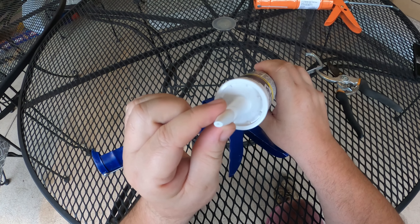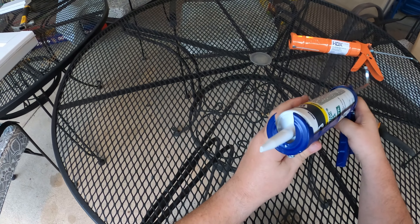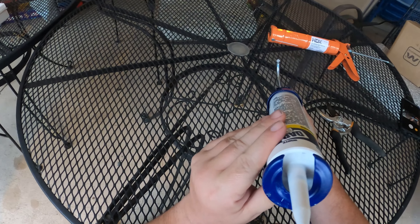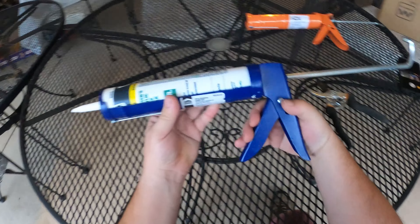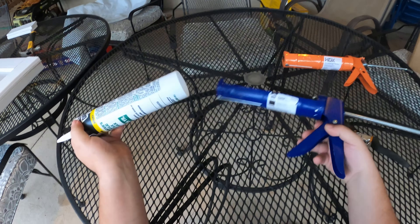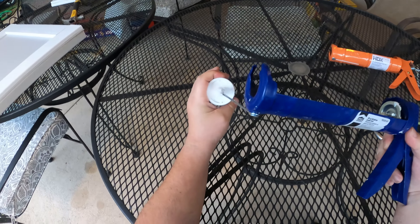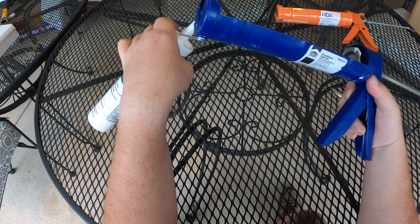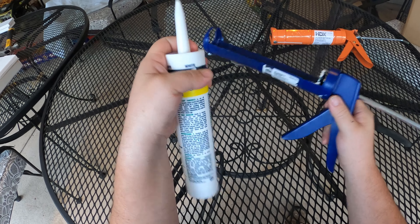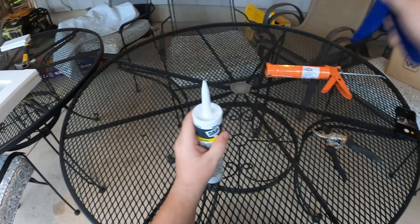Now if you've never used a caulk gun, you might think we're good to go and load this up. But if you try doing this, one of three things will happen: either it comes out magically — which it's not supposed to — or you pull and nothing happens and you think your caulk is defective, or you keep pulling until the thing is going to explode back into your gun. The first thing you do whenever you load caulk is take this little needle on the end and spool it out — there is a seal inside the nozzle that you need to puncture first.